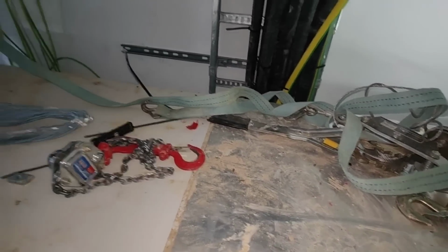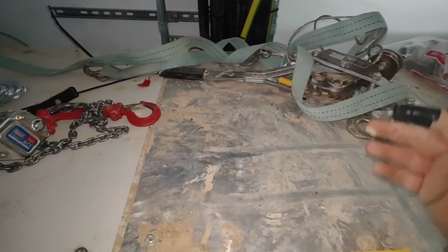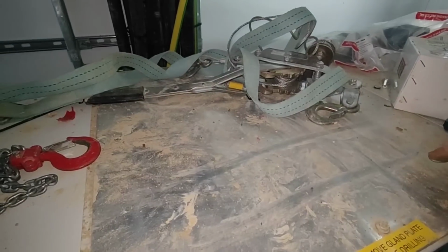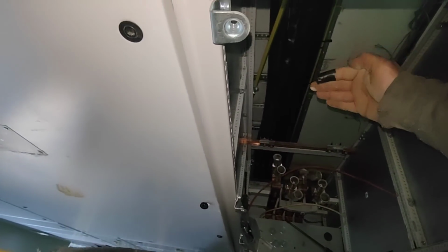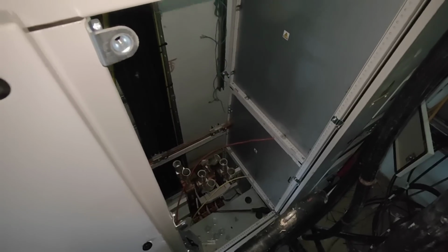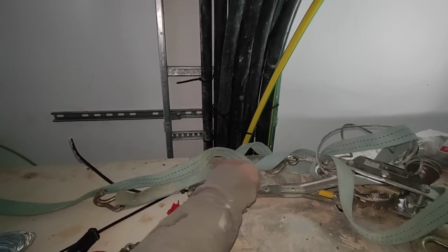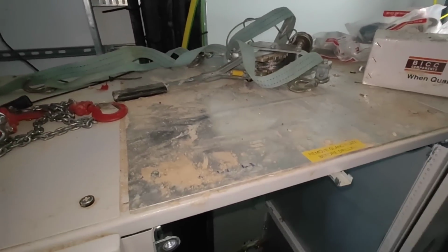That's the first line, so that's those ones, right? I'm hoping they can drop in somewhere there, 1, 2, 3, 4. And then what that'll do is the other ones behind will just lay on top of those and then peel over the front and that can hit there, 1, 2, 3, 4. Then inside, because that's sort of here, it's nowhere near those, I'll have to bend them inside. I don't really relish the thought of bending 630 mil single cores, but I can't get them directly above the holes, which some of them is like here, and there's absolutely no way that's happening. So I shall have to compromise.